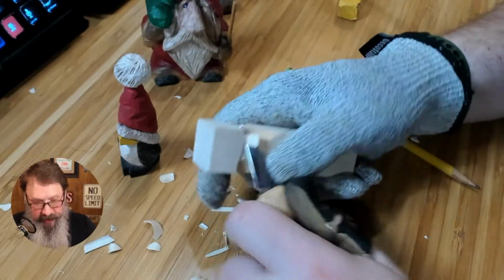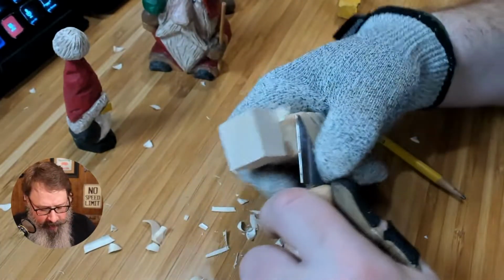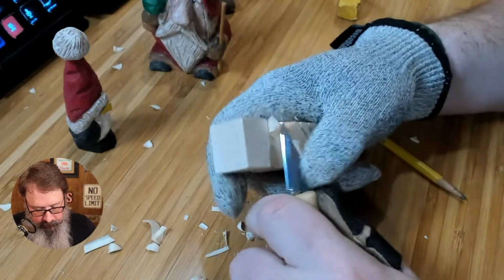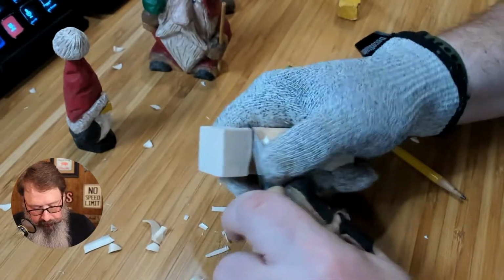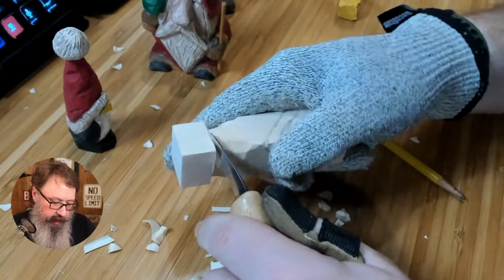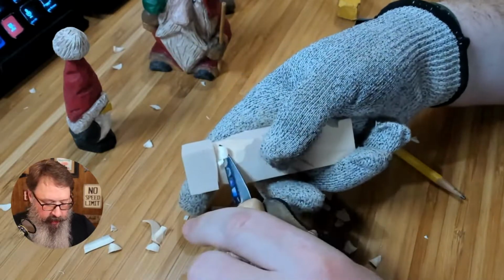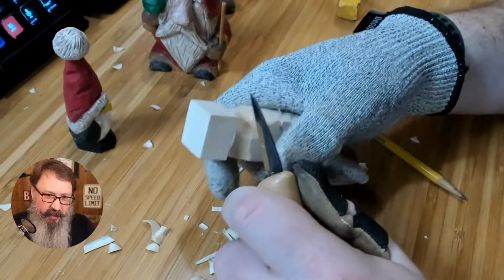So what I'm doing now is just taking some wood off down in this area, right here. See where the top is, and I'll start rounding out the top. Now you could use a bandsaw and take some of this wood out, but I like to take some wood off doing it this way, because it's a little therapeutic for me. I'm just going up to where I cut, and then it pops out, just like that. And if it doesn't, if it feathers a little bit, you just go in there and make another cut, just like that.